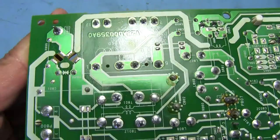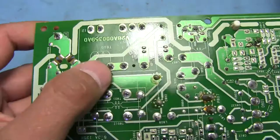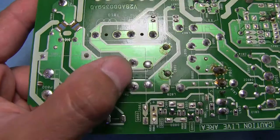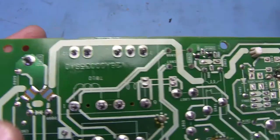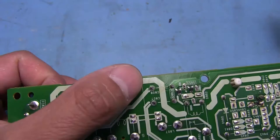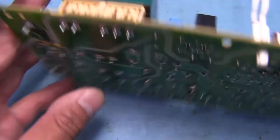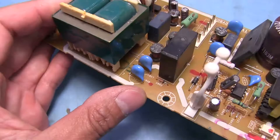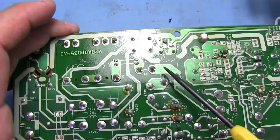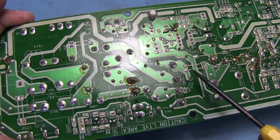It looks like we've got two windings right there, so we have our input coming in through this common mode choke. One side goes off to here, so I guess it's just being used as a choke. These two are bridged here — so this is not a transformer as far as I can tell, because the other side doesn't have any traces and isn't connected to anything. That definitely looks like some sort of a choke. There are also two little jumpers on the other side. That goes through another inductor, and this big trace goes to the connector that goes to the ballast for the lamp. Basically this is filtering for the lamp ballast.